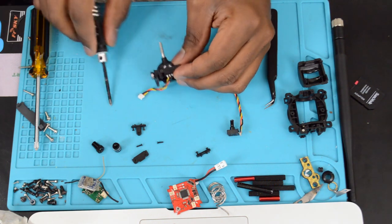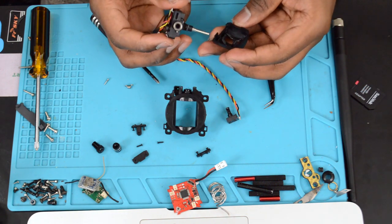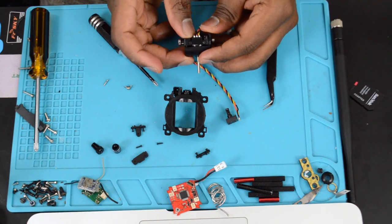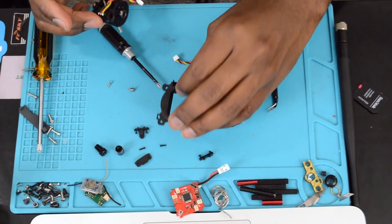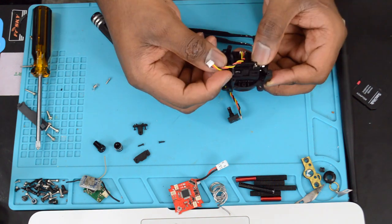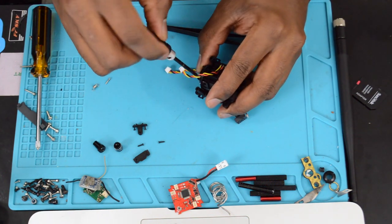In the future I plan to model a 3D printed part that will be stronger — it'll be thicker so it pushes on the potentiometer more and you won't need paper or foil. For now, put the little cap back on top of the gimbal, make sure you line it up properly because it also blocks the potentiometer from coming out. Then screw the retainers back on from the bearings and make sure they're nice and snug.